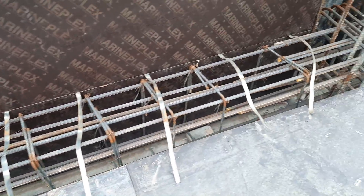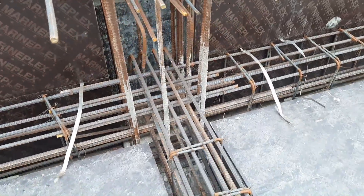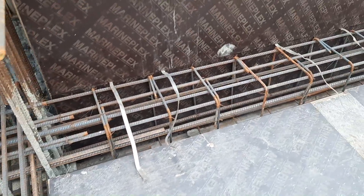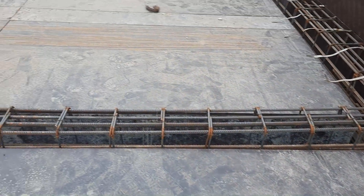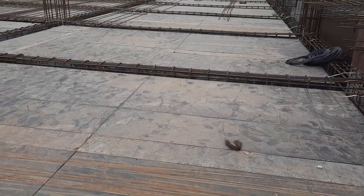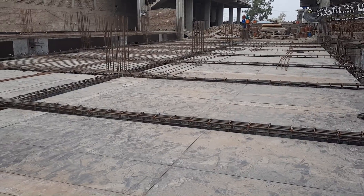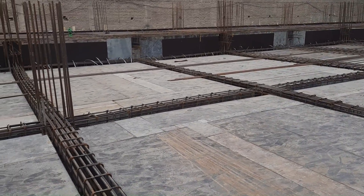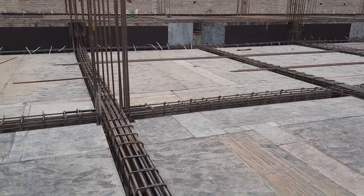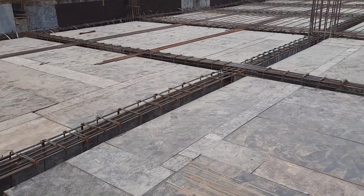You can see four steel rods at the top, four at the bottom, and two side bars. This is the junction between beam and column, but they did not provide extra steel rods here, which is also one of the big mistakes. You can see the formwork which they did properly. They did some common mistakes in the construction of this floor beam steel reinforcement — I think they didn't have a site supervisor to guide them.